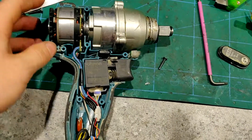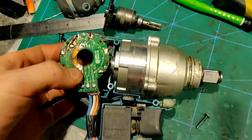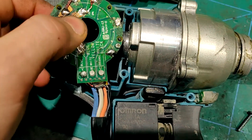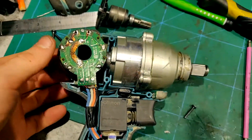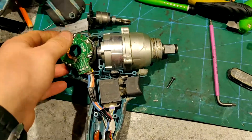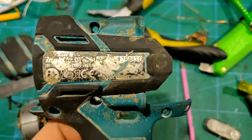What I did was I opened it up and looked at the coil, and what I noticed was that this part right here where I have this wick was completely burnt off. So I fixed that with some wick, put it back together, and then it burnt out right under this part right here. So obviously the issue was a short in the coil, and this was an old tool — as you can see, it's pretty used.